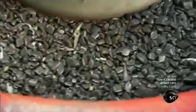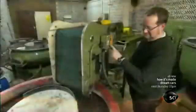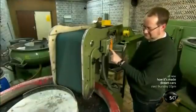They transfer the nipper shanks to a finishing machine. They bounce around in a stream of abrasive ceramic pebbles for a few hours. This rubs off the rough bits. A magnetized conveyor pulls out the steel shanks, leaving the ceramics behind, and carries the shanks forward.